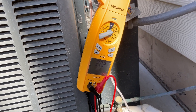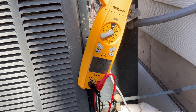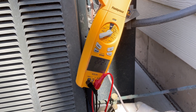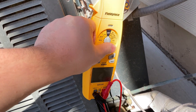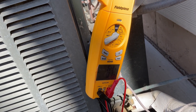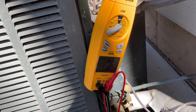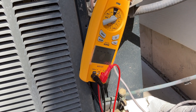That's already a significant reduction — down to 22.2 amps from 93, so that was pretty awesome. We'll check the running amperage next. It looks like the running amps are about the same. It's also a little warmer than it was earlier today before I wired it up, but it certainly decreased the starting amperage by a long shot.